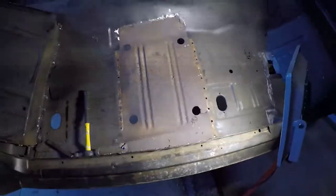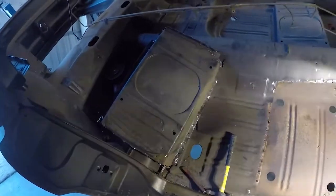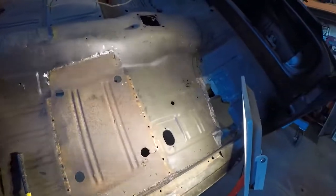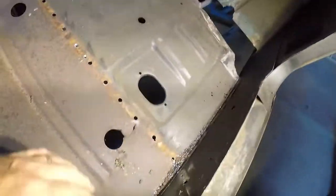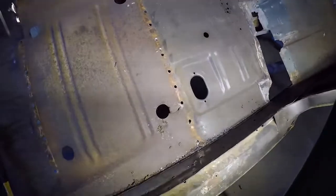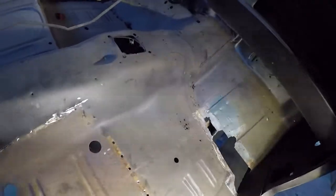Alright, there's a bit of an update — it's not really that massive a job, and putting it back isn't hard either. Pretty confident with the mark out at the front — we're going to have the front floor pan across there, and then the secondary pan comes down to about here somewhere. We'll have that nice little section hidden away there, all seam sealed of course to stop any moisture getting in. It's coming along okay.